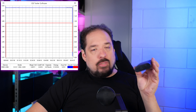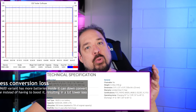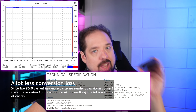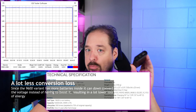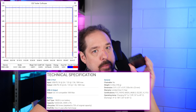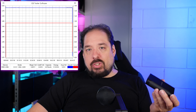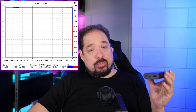Looking at the 31.5 watt-hours, we see again that this perfectly aligns with what OmniCharge states on their website. So this thing is performing exactly as specified. If we look at the voltage graph again from the test I did — there's just nothing you can say about that. It's a flat line again — perfect regulation, and really, really excellent for a power bank.